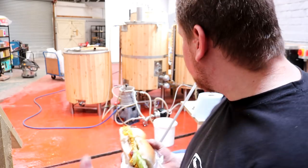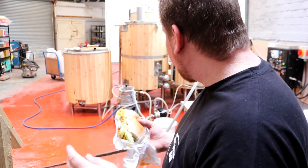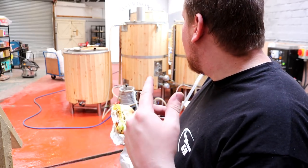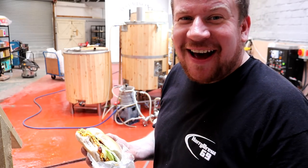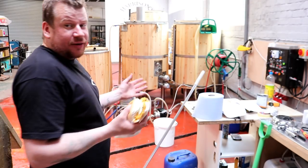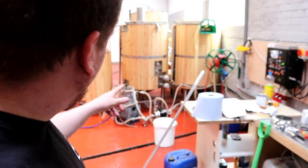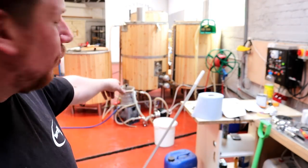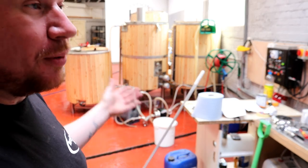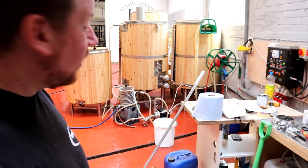So I can report that the pump squealing was my fault because it was running dry. I had a valve closed. Anyway, disaster averted. I have found though that if I run the feed out the bottom manway hole, basically the kettle drainage, it brings the trub, so it does block it up and cause it to squeal. But the side takeoff that we finished yesterday is working perfectly.